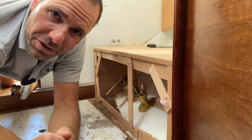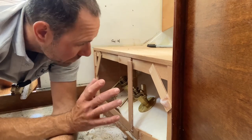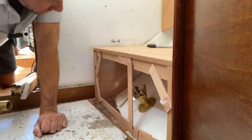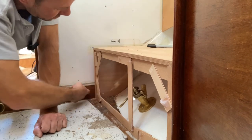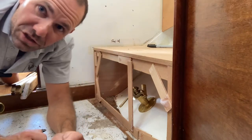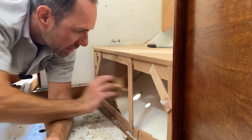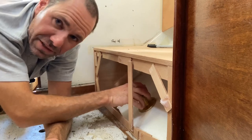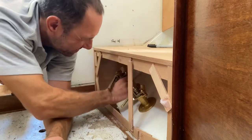I've been pushing on with the work here slightly off camera — apologies, but sometimes I've just got to get the work done. There's an additional support that I've put in, screwed into the side here and attached into the top, which stiffens up this side and gives it the support it needs. I've then worked out roughly where I want the seacocks to go — you can see there are two nice neat holes in the hull there, which I checked and double-checked and triple-checked before drilling.